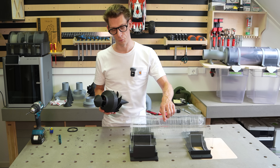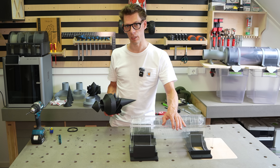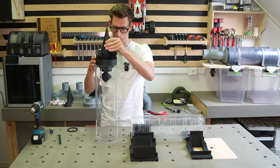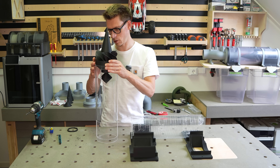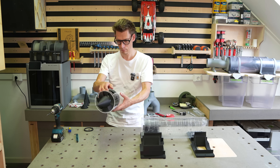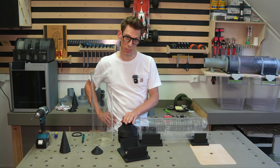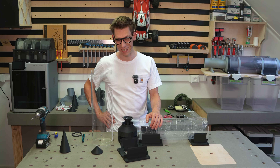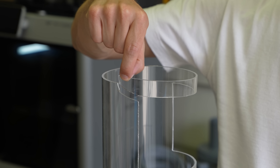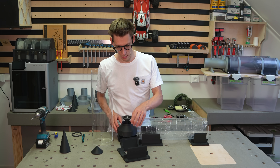The heart of the separator is ready now to fit inside of the tube. There is a groove in the shroud that fits inside of the lip of the front dustport, so we need to take this apart and put the assembly into the tube. This is a tight fit, so take your time for that. The way I designed this assembly for the PVC version of my separator, it definitely won't work with the acrylic one. Acrylic is in no way flexible and it snaps off really fast.